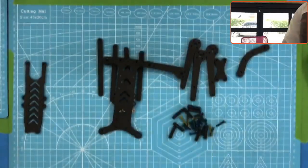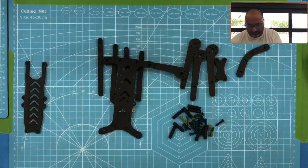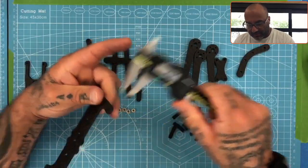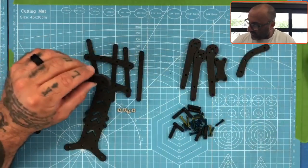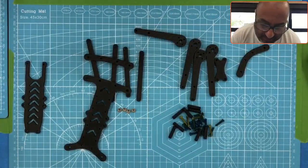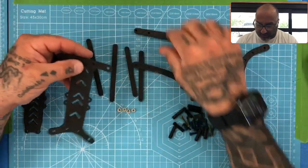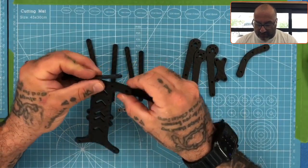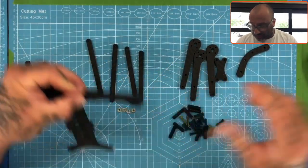Let me get the calipers and just measure for sure, because I know we made some changes on the carbon fiber. Let's zero that out — we're going to have about three and three, and then this one will be about five. So yeah, you've got about 11 millimeters of carbon fiber, give or take. Let's say almost 11 millimeters as your front bumper, and the reason I did that was for impact — the front of the frame is going to be hit with 11 millimeters right there, and that's extremely solid.